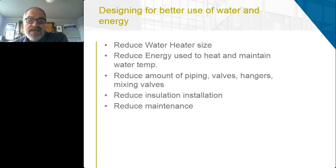And since we have that temperature issue with wanting to keep our water hot so it's safely out of the waterborne pathogen growth range, we have to circulate all the time. And we find that you spend more energy circulating, heating that recirculated water to replace the water that's been lost through the insulation than you do spend on heating water that's actually been used to wash hands.